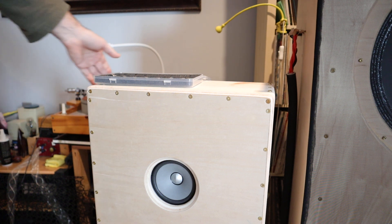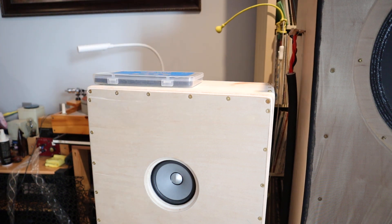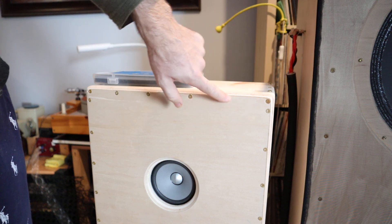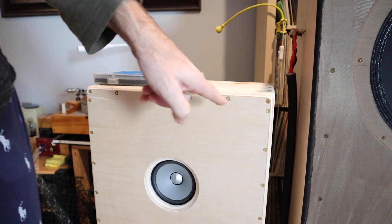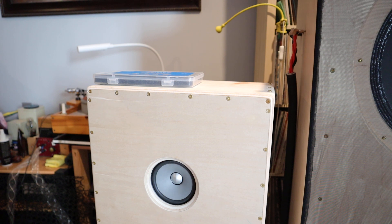So that's what I wanted to say: when you are making your cabinets and using screws, this is a very important consideration. With this method I put in over a hundred screws in two cabinets and not a single one stripped — I didn't have a problem with a single one. And that's because of pre-drilling the hole for the screws, and the hole needs to be the same length.